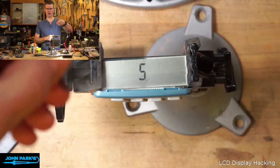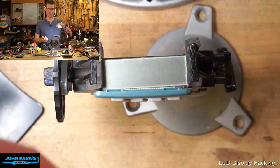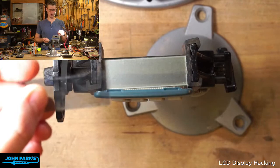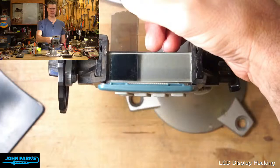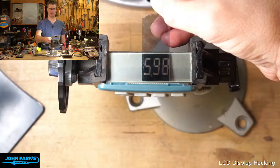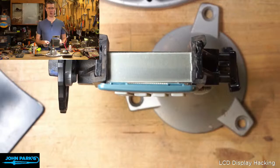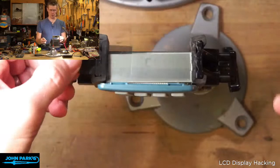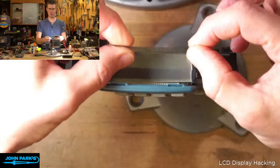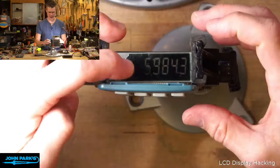Now, a really cool modification hack to this is if you turn this 90 degrees, you'll see it is now blocking the unlit part of the display and not blocking the lit part of the display. So it inverts it. So if you've ever seen a wristwatch that's trying to be super cool, it may have this sort of backwards looking display, and that's how this works, the polarizer is simply reversed. Now, you don't just have to turn it 90 degrees, you can also flip it over, which means you're still gonna get the same ratio that you originally had, and now you have this cool inverted display.